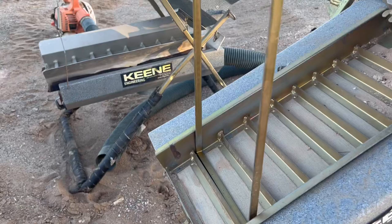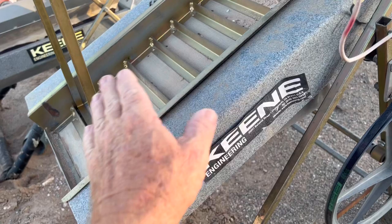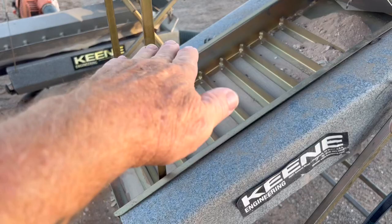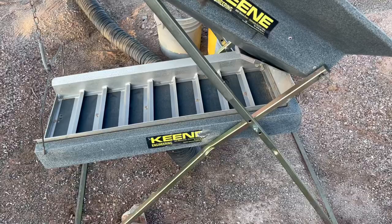The pitch on the puffer style is a little steeper because it can't as easily move material along — it has to be able to puff it down. The radial fan model can be run a little more level because material just kind of moves along. But today I'm going to be using the big one — this is the 151. They've made a couple changes since then and there's a newer model out now, but this is the one I'm using.